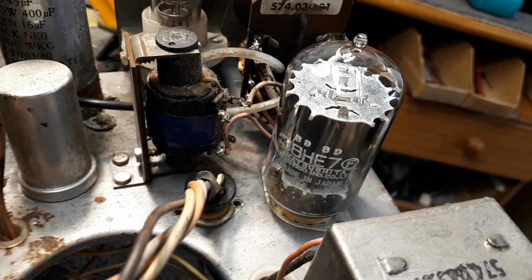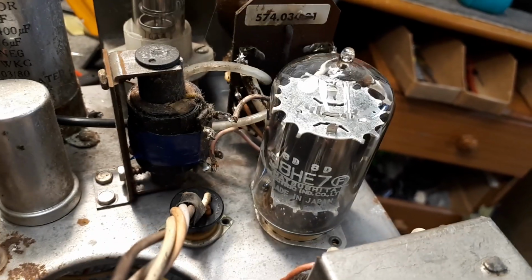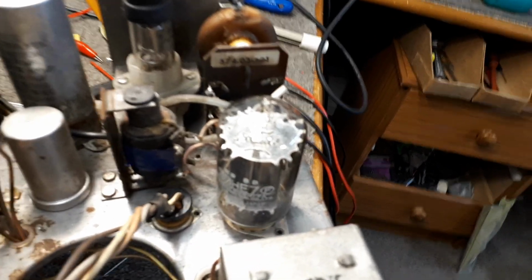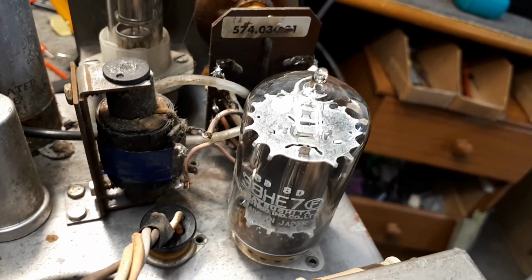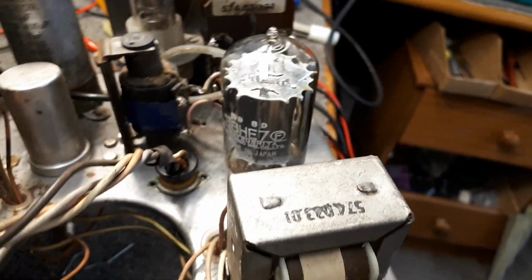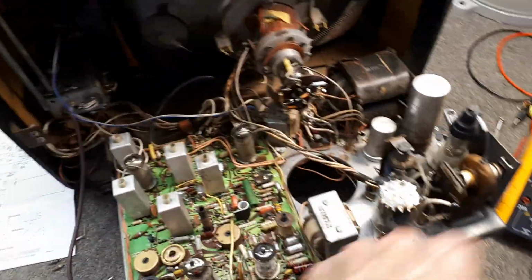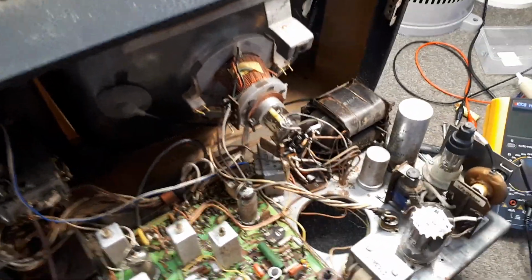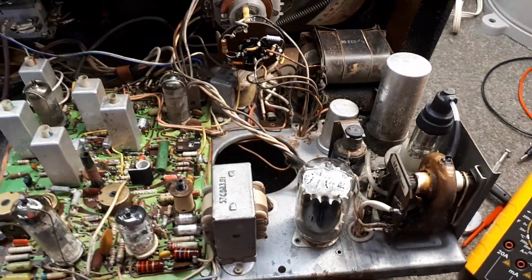I'm guessing these would be a bit like the compactron that the American sets used. I'm not sure if these are used in any American sets. I'm guessing probably more of Japanese origin. In fact, that one's got Matsushita on it. So yeah, National Panasonic. And I guess they were used in quite a few sets, a lot of the smaller ones. This chassis layout had various inclinations. The bigger sets had a separate boost diode and line output valve, but these smaller ones had these dual ones.